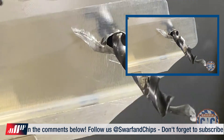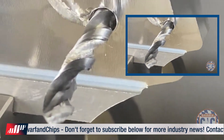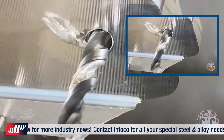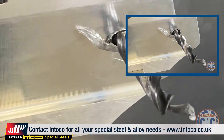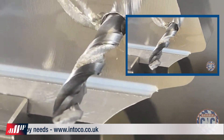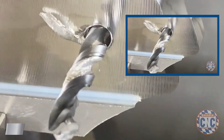What we could do with that to get it out is we could use an electrical discharge machine — like a zapper. It has an electrode which sends a current down the middle of the drill, which will basically split the drill into three pieces, so you could then easily retract the drill out of the hole. Nine times out of ten they work, but probably in this instance you'll be able to use some sort of lubrication to lube the area and gently pull it out.